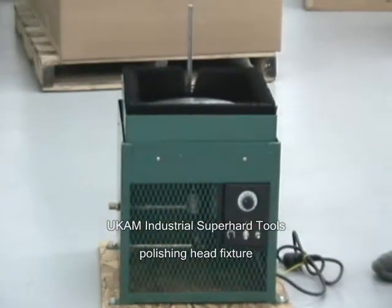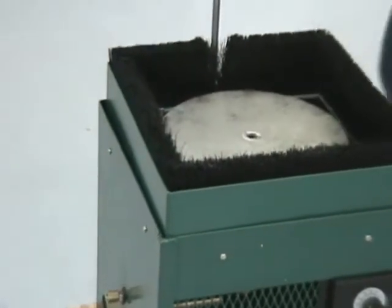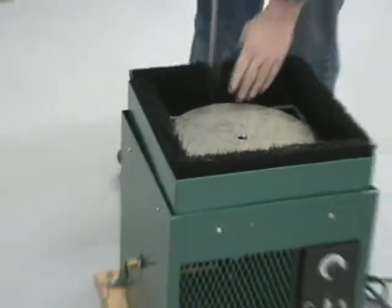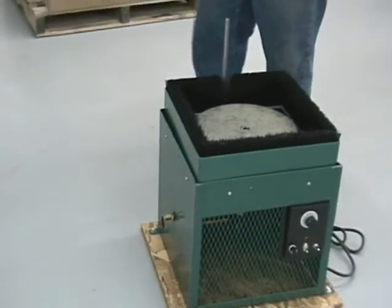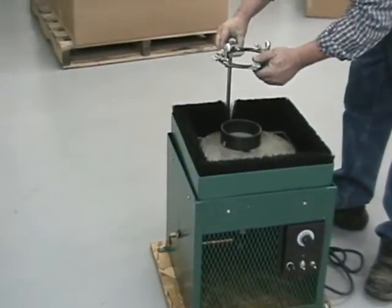Horizontal machine, and it has diamond laps with a magnetic 12-inch diamond lap you have put on there, and we have a water hookup right here where the water goes through here and comes right out through the center. We're demoing the lapping attachment, and we're going to put a lapping attachment we have for this machine, and it goes here.